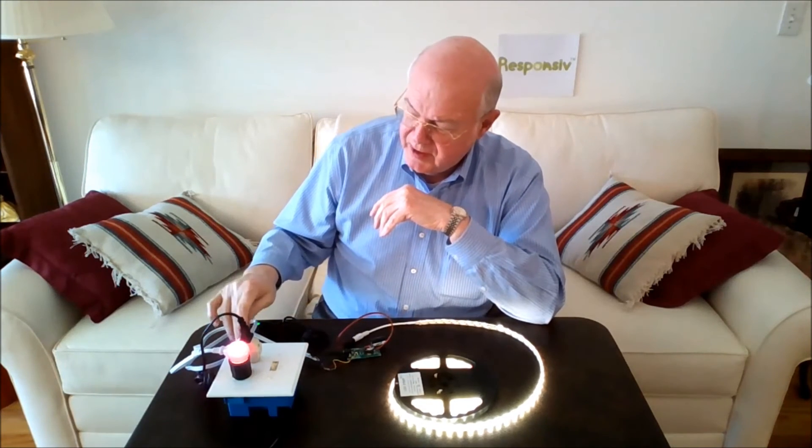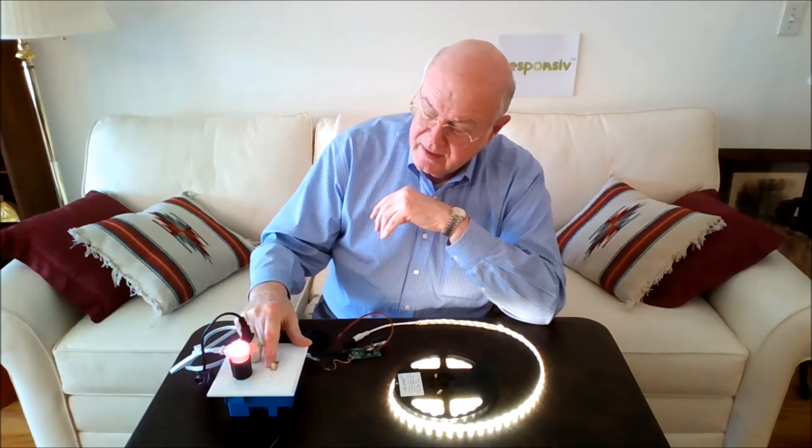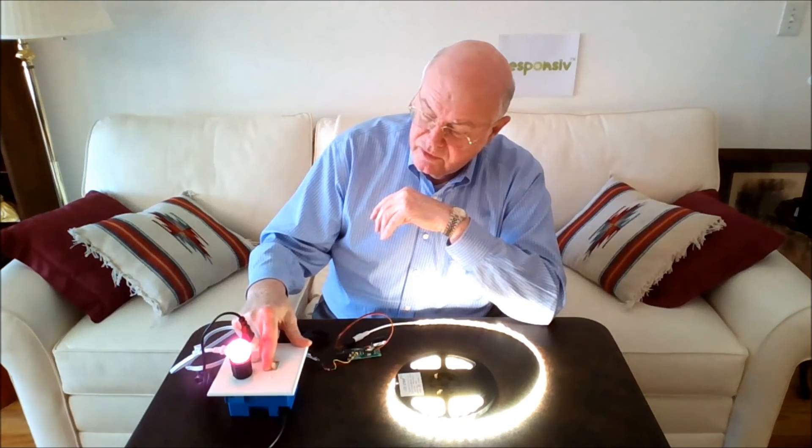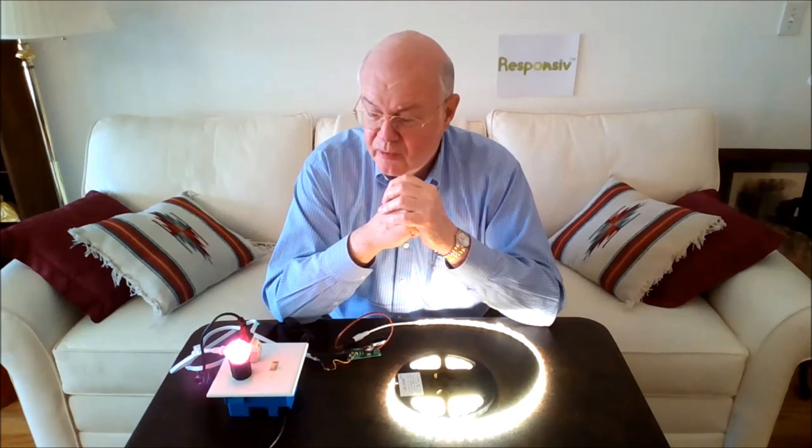But that expectation doesn't always hold for these LED power supplies, and this LEDMO model is an example of that. The reason is that some power supplies, including this one, during the power-off portion of the waveform, feed some reactive currents back into their power pin. When the AC line is disconnected, it's high impedance, so even a tiny amount of reactive current can produce considerable voltage. And that voltage can confuse the power sensing circuit and make the dimming not work so well.